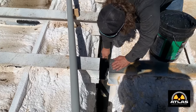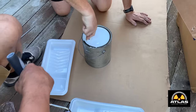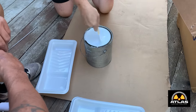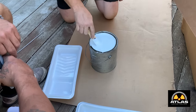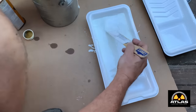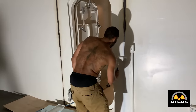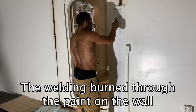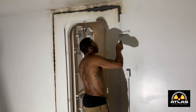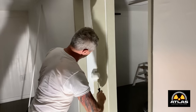He's mixing a two-part epoxy - that's what we use for the walls. This stuff only has about an hour and a half life before it hardens up and you can't use it, so don't mix up more than you need for that day. We're going to try to get two coats on the hardy board and a single coat on everything else, rolling it on. He's put some xylene in there to thin it out - otherwise it's too pasty. We're starting to do the touch-up paint. It takes two coats of this epoxy. You want to use a foam roller instead of the little hairy brush, otherwise it leaves a texture.